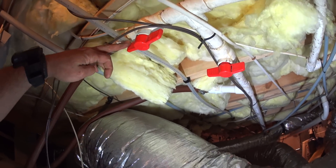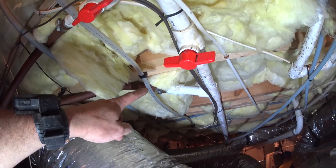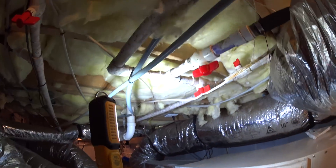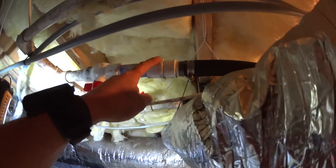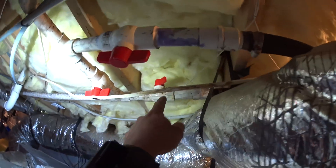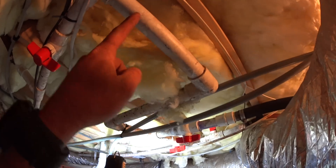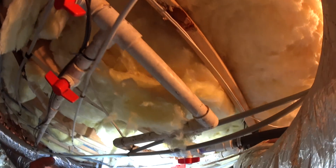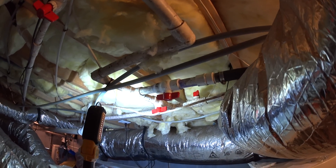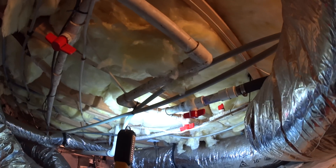They're all connected in and out to the same piping. This valve here is inlet water loop. That line is outlet water loop. We've got a shutoff here which separates the two. But over here we've got — I don't know — in or out. Let me double check. In water is the red line. So we've got inlet water here, outlet water here. And that comes over and runs over here. Water for the outlet off of the package unit runs into the split unit. That can't be right.